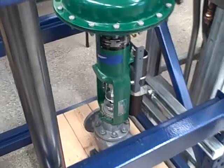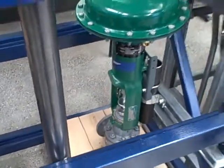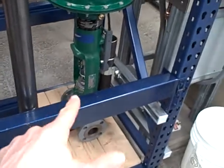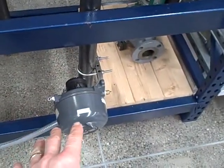After that is done, we'll do troubleshooting. I will fault something in this valve system — I could introduce a pneumatic fault in the valve somewhere, a travel fault in the way the stem's set up, or I could introduce a fault inside the mechanism of the I2P.